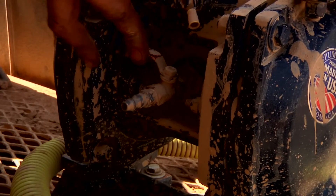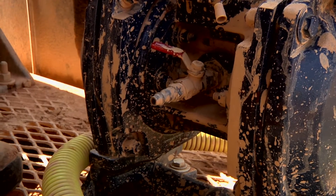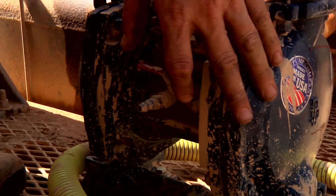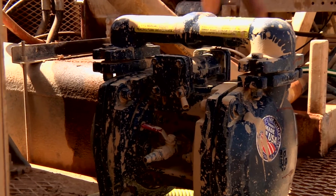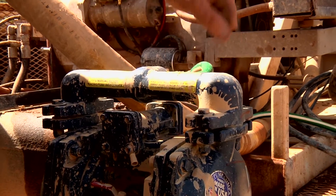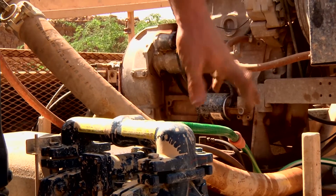This is off, this is wide open — we never run it anywhere near wide open during operation. You just want to crack this thing about like that, and you measure the flow by what's coming out at the discharge here. Remember it's sucking in on the yellow hose, the air is making the pump work just like the big one, and it's discharging through the garden hose. When this garden hose is pumping right, you should get a surge about every three seconds — that's plenty of foam going down hole.